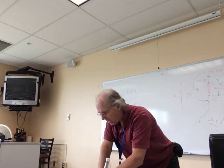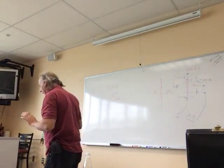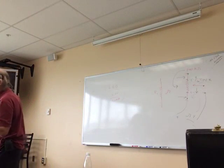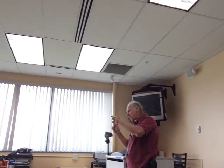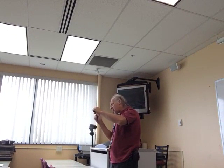Now, if you're going to use a voltage divider to drive a black box circuit and you know the resistance and voltage for that black box circuit, then you can tell what the current's going to be out of that black box circuit. Then you design your voltage divider to give you the proper voltage by placing that in. You say, okay, I've got a parallel resistor, so I know what size resistor here will give me the proper voltage so I get current through the black box to make it operate.